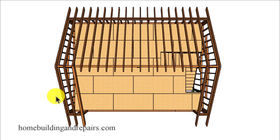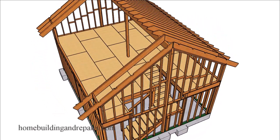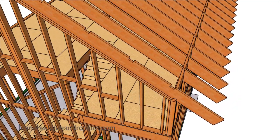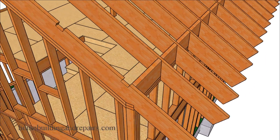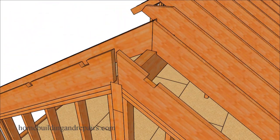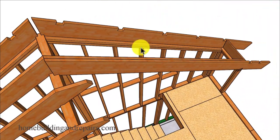I'm going to provide you with two different designs along with two different fascia details. With that said, let's start our tour of the building. We have our shaped blocks again along with notches for our lookouts that will support the fascia board. The block at the top will cantilever out to help support the fascia board at the top along with our double rafter.